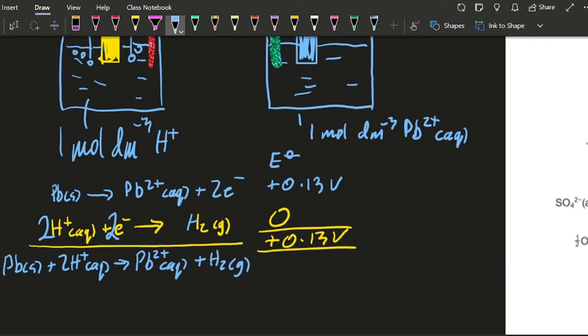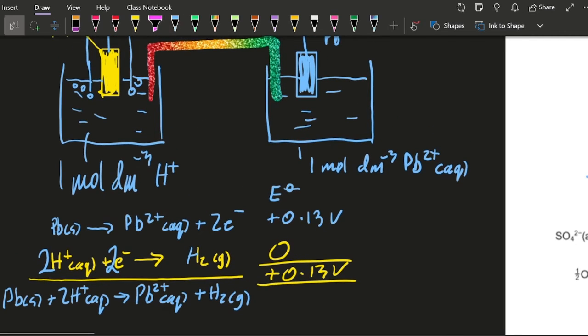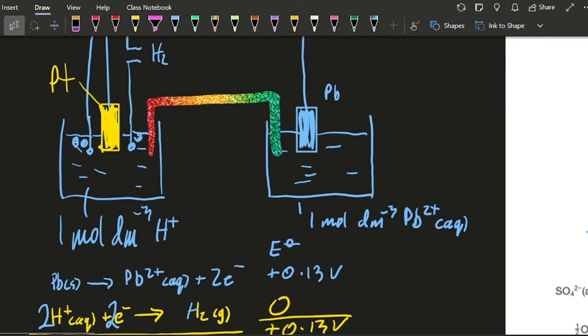So what does that mean? Well, I think probably there'll be more bubbles of gas coming out since I'm making more H2 here — that's the gas. And what's going to happen to my solid lump of lead in that half cell? Well, it looks like it turns into aqueous lead two ions. So that solid lump of lead is going to be slowly eaten away, bit by bit. And when it's all gone, the battery's dead.